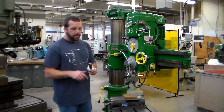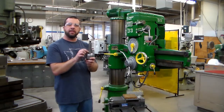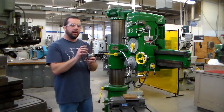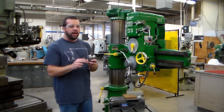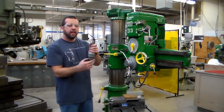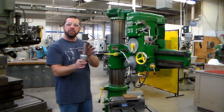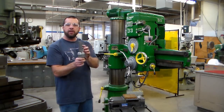One last thing, I did mention that nothing is holding this inside the spindle except for the shallow taper angle. A shallow taper like this is considered a locking taper. And after I seat this tool holder up in the spindle and then I gently tap the face, the wedging action that's taking place will actually put a tremendous amount of clamping force down on our tool holder.